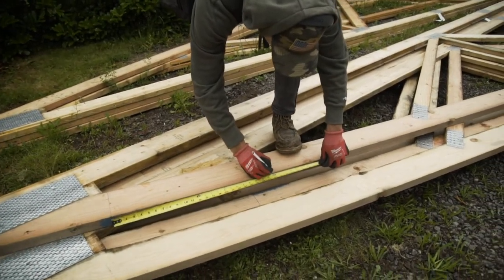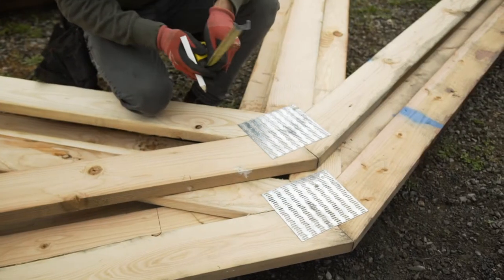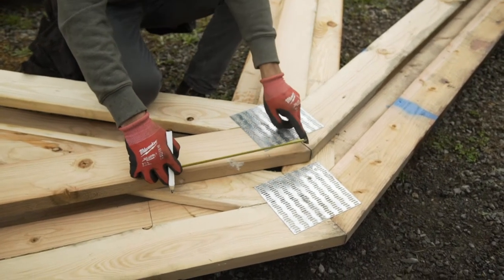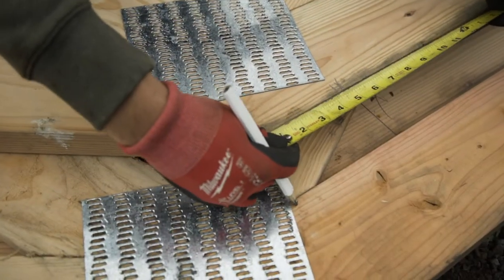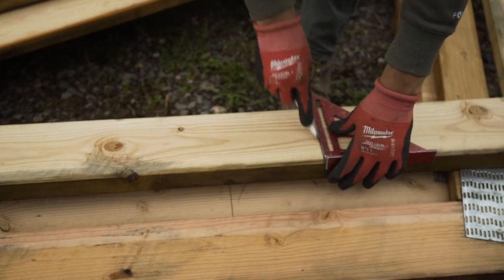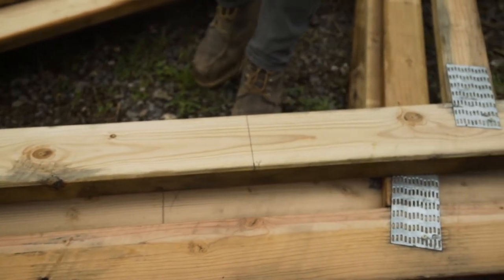The top purlin block is to be 4 to 5 inches from the peak. This will make the top two purlins closer than 24 inches. Draw a line on the side of the truss where you marked it out. That line will be used for setting your blocks later.